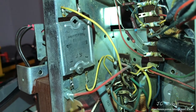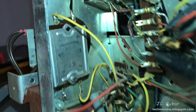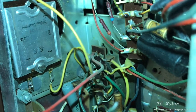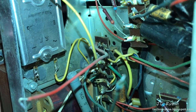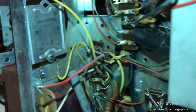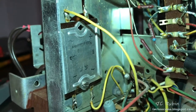This should go without saying, but I'll mention it again. If you're going to disconnect off the rectifier, the connection you should be disconnecting should be off of the rectifier itself. You shouldn't be disconnecting the connection that the rectifier connects to, because then you end up with 250 volts of DC with no load on it, just floating, waiting to touch ground or you or something else. That's really a bad idea. By disconnecting it right off the rectifier, nothing on the radio has the high-tension DC — it's just sitting here as test points and it's not going to short to anything. That's a smart thing to do.